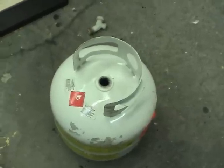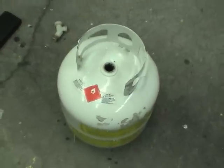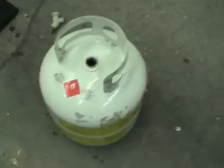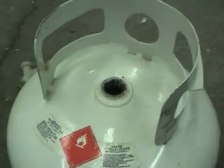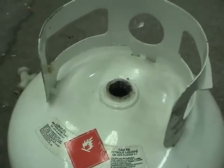This is all rinsed out now, but we're not done yet. There's one critical thing you have to do before using it for air, and that is coat the inside of the tank with a rust proof paint or rust primer. That's because the air and water in the compressed air will cause the inside of the tank to rust, and that could weaken it and cause it to explode later.